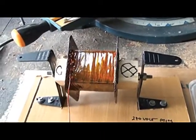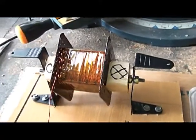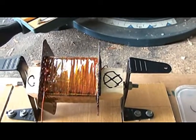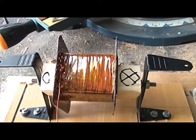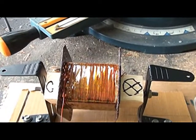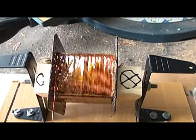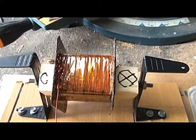When winding these transformers, there are certain regulations you need to follow. One of them is that the insulation between the primary and the secondary must be at least 3 kV. Also, there must be a 6mm air gap between the primary and any secondary. That's achieved by laying the last turn on the last layer at least 3mm in from the end, and similarly for the first winding of the second layer — that then leaves a 6mm air gap. Usually there will be a filler in there to stop the wire creeping across that gap.